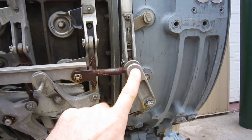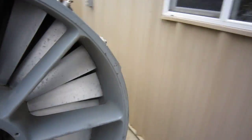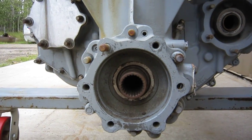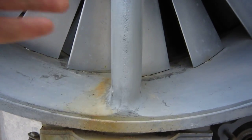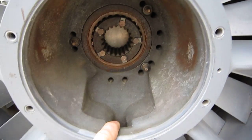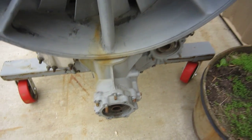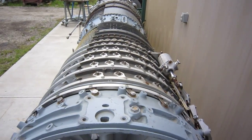We'll look at the actuating bar and cylinder for the variable stator vanes — it's connected and also works the variable intake guide vanes, but these turn in the opposite direction. There are two of those, one on each side. When we want to start this thing, the starter attaches right there on the gearbox. There's a shaft running inside this strut with an angle drive — it turns a gear, turns the shaft, turns the gearbox. Now you're an expert on the J79 turbojet engine.